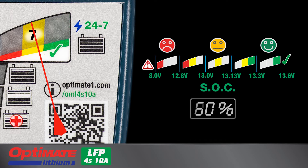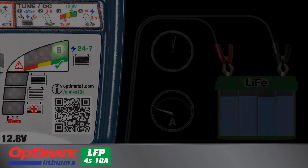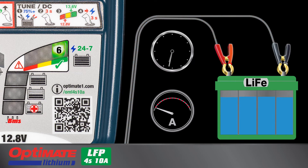Lamps 6, 7, and/or 8 indicate the battery's ability to retain charge. Lamp 6 will remain on for a healthy battery able to retain 90 percent or higher charge. Lamps 7 and/or 8 light for weaker batteries, or if the battery is losing charge fast due to high current draw from the vehicle's circuitry. The 24/7 maintenance program follows once the test concludes. The battery's charge level is monitored and it will periodically receive maintenance charge to keep the battery charged and healthy within the vehicle.